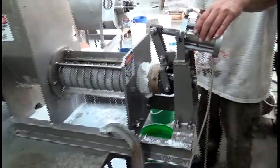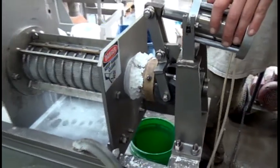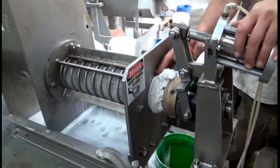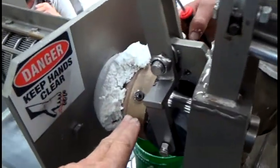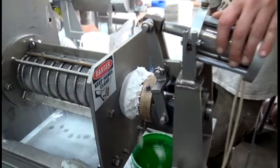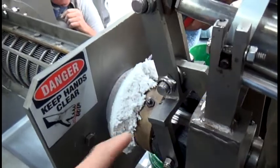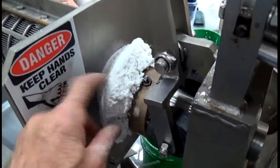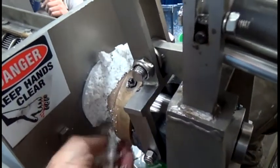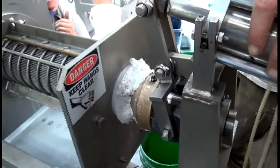We're operating essentially with a fixed orifice and the cone that's wide open. We could set a press to run this way — we don't even need for this cone to float in and out. In case something soupy happens, we want to be able to close the door and close the cone. You can have this cone rotate with a stripper pin on it and it will break up this material, so a rotating cone option would be a good one for this right now.